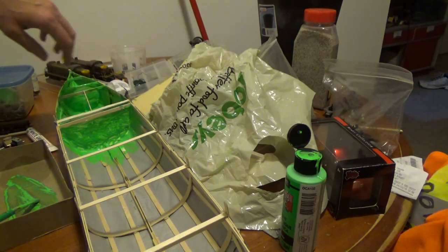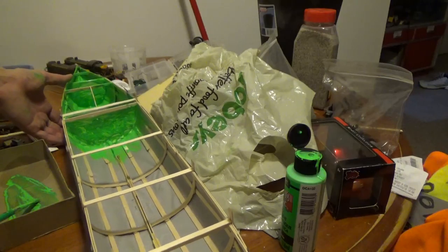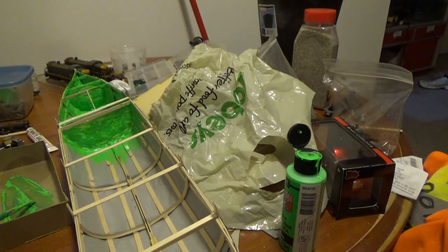There's going to be a smaller bulkhead, about half the size, so that if something punctures the hull into here, say it hits a rock at a fast speed and the fiberglass punctures, or it gets stuck on a rock and it's quite wavy and windy and does enough damage to puncture through, it's not going to flood through the other way. But it can happen. I'm not saying that it won't, and this thing may never have those problems. But I've had a boat that got stuck and just kept banging on the rocks, out for 12 hours or even overnight, and I went and got it the next day. There were holes in it, but she stayed afloat, and the bulkheads held.